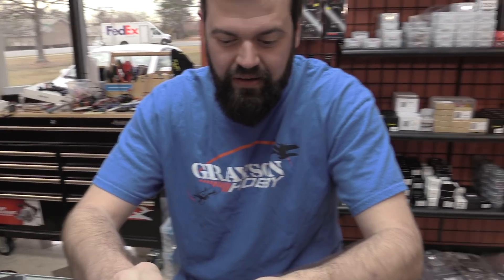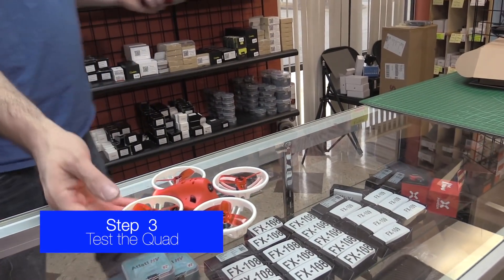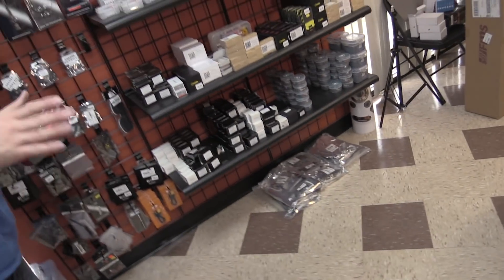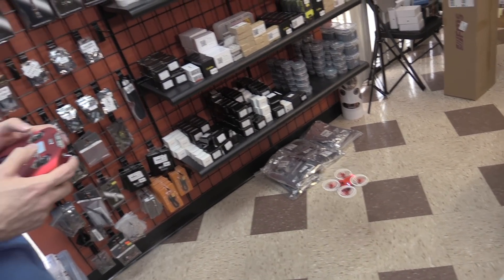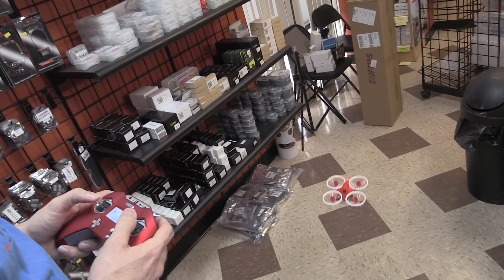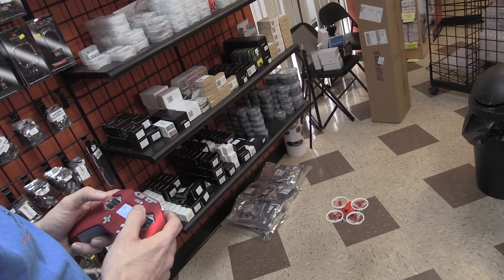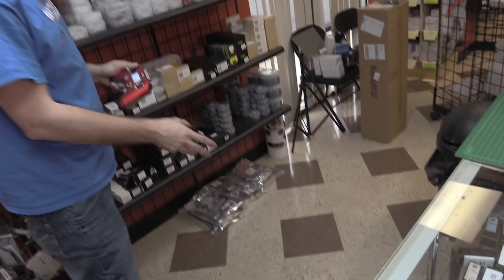So now the front is the back and the back is the front. I'm going to put it down on the floor and use the LED as the front of the quad. All it did is reverse everything electronically — instead of taking the motor, unplugging it, and moving it to a different port, because the pins are part of the board and there are no movable wires or plugs, you can do the resource mapping by changing what pin controls what motor.